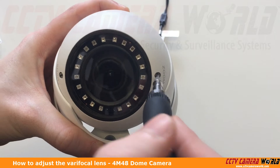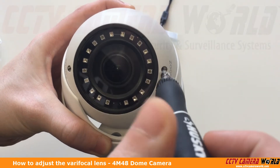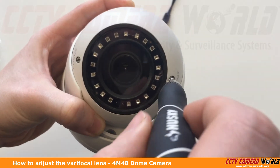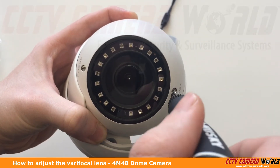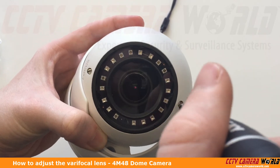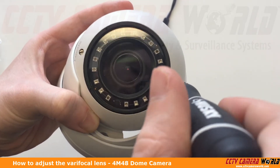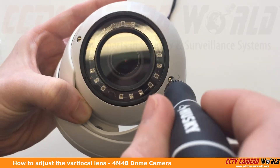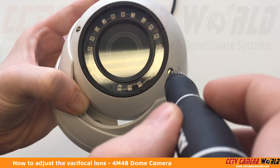We would just adjust the zoom and focus by turning these ever so slightly. We're using a small hand flathead screwdriver here — you may have a watch screwdriver or something like that. But you never want to force these anyway. I'm at the end of the zoom here and I don't want to force this any further, otherwise I will damage the internal zoom mechanism.